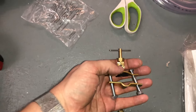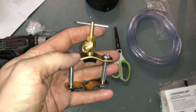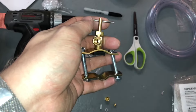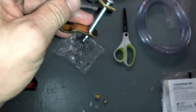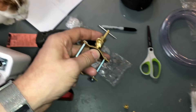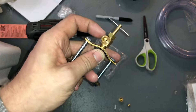The other end is going to go to the same type of deal, which goes into this saddle valve. All you have to do on these — they're actually really cool — is tighten it down. You've got the two nuts and screws on top of your water pipe, make sure it's nice and tight. Then literally all you do is twist this handle until the incredibly sharp tip in there punctures your half or three-quarter inch water line, and then you've got water coming out of here. My only recommendation would be to hook everything up, do your compression nuts, and actually hook it up to the humidifier first — that way if you do get some water, which you will, you don't make a mess.